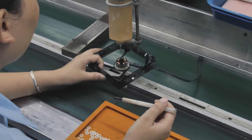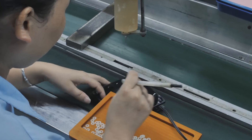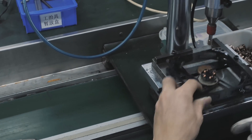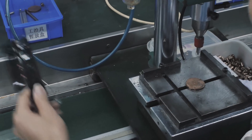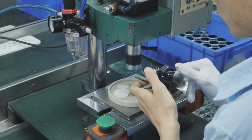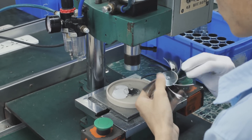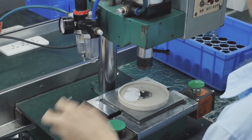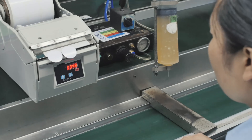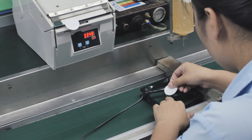Here we have something really important — it's not going to spin without this. She's going to apply some oil and then it moves down the conveyor belt. He grabs it and applies a bearing right in the center, so the bearing is nicely oiled. Once the bearing goes through, here's where the fan blades are applied. The housing and everything is ready. We have a metal ring that goes on the inside as well and this presses it into place. We're putting some more oil into the bearing, and once the bearing is finished preparing, we can put the blades into the housing and we're good to go.